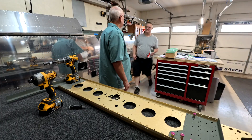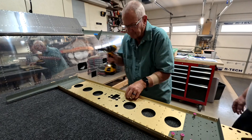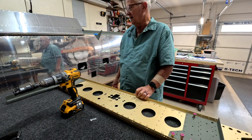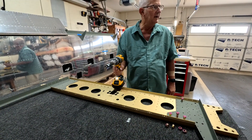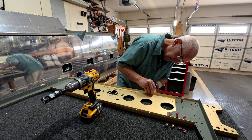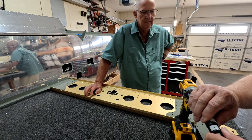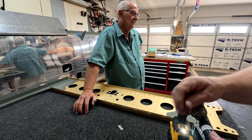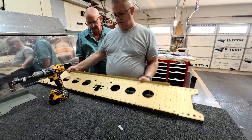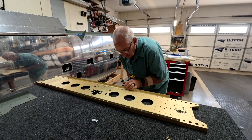Notice my pink bolts — what I did instead of using the bolts that came in the kit is I went and bought similar-size bolts from Ace Hardware. Those kit bolts are compression bolts that you're supposed to torque down, but the instructions say not to final-torque them yet. So I bought the right size bolts and nuts — they weren't very expensive — and then I painted them pink so I would know those are not the actual production bolts; they're just there to hold things together while I assemble.